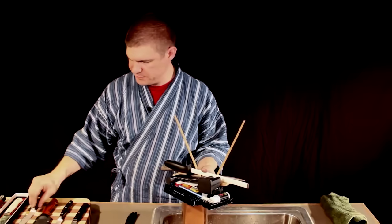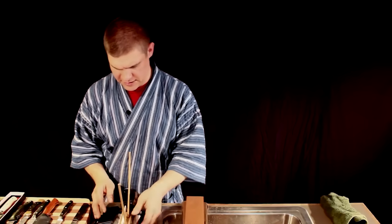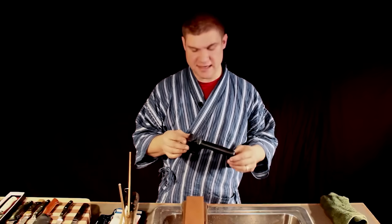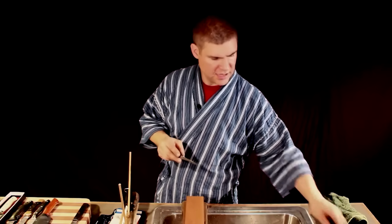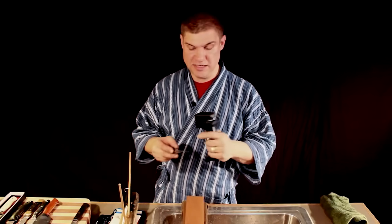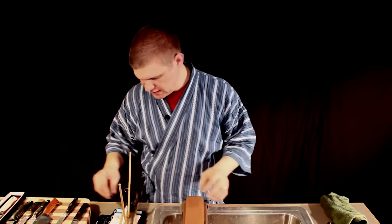Here is a plethora of things that you may see in the marketplace for sharpening. You might see some kind of a little device like this, designed for just pulling the edge through. This kind of a sharpening system doesn't take into account at all that you need to grind the secondary edges. It only addresses the primary edge.